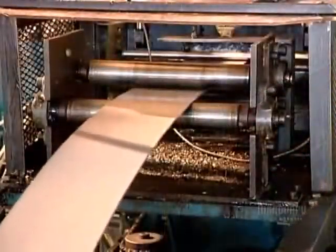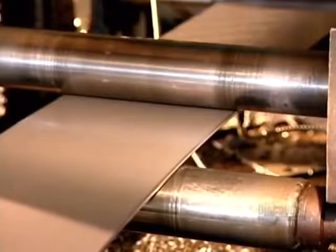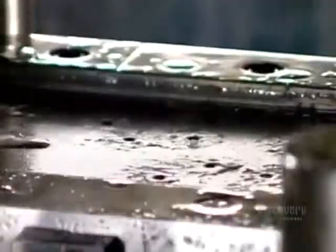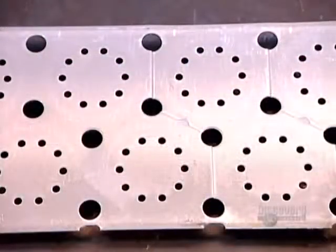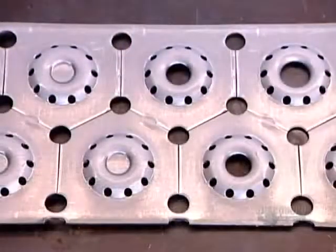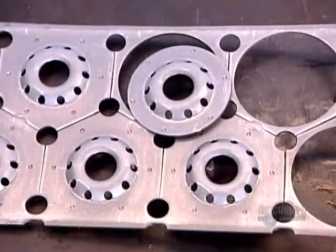Many oil filter parts are made from steel coil — a sheet of steel on a roll. They start by unwinding the roll and feeding the coil into a press. The press contains a series of dies, each of which progressively stamps the steel into the shape of the specific part. This press is churning out tapping plates — part of the component on the end of the oil filter that screws onto the car's engine.